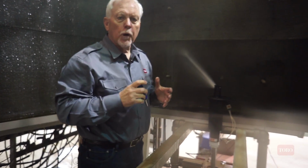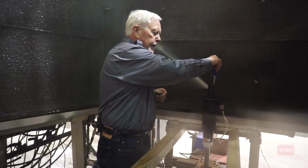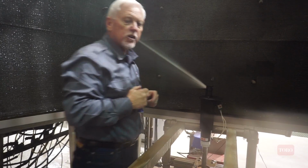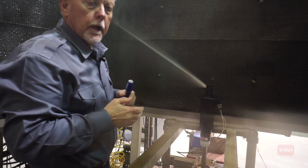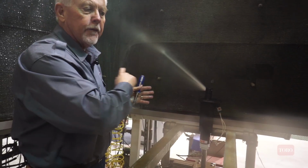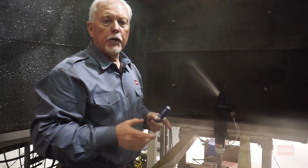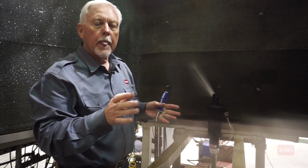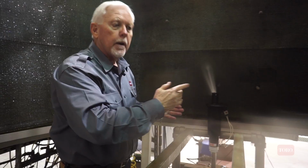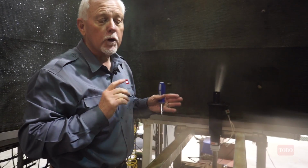All right, if I want to make the sprinkler from part circle to full circle, that is done by making the white adjustment, turning it from the part circle position to the full circle position. Now at that point, the sprinkler is going to become a true full circle, but it will continue rotating in the direction that it was turning when I made the change from part to full. If you recall on the Toro Sprinkler, when I make it a full circle, it potentially could go counterclockwise, stop, but then returns to full circle mode in the true full clockwise position.